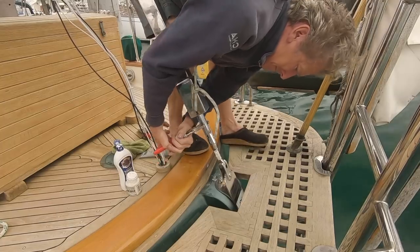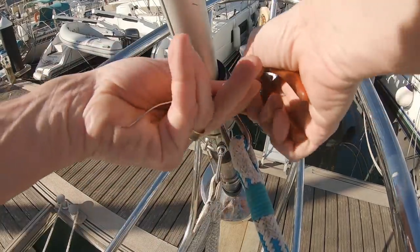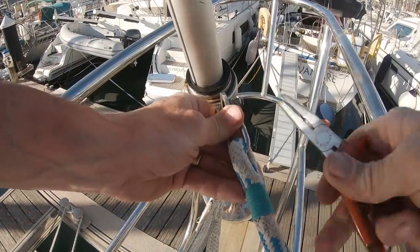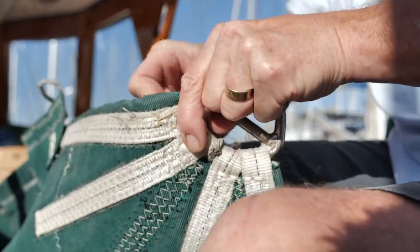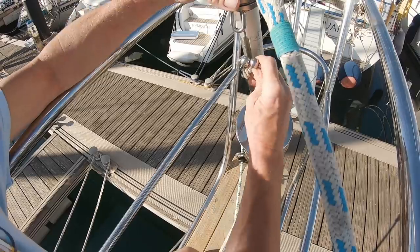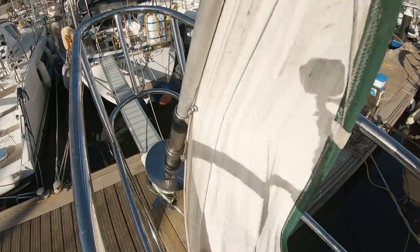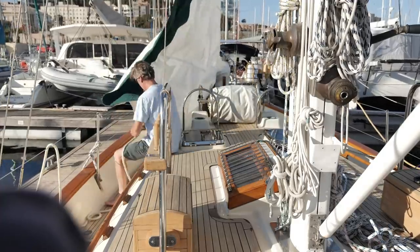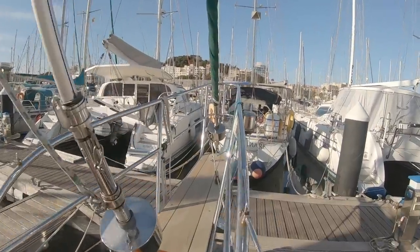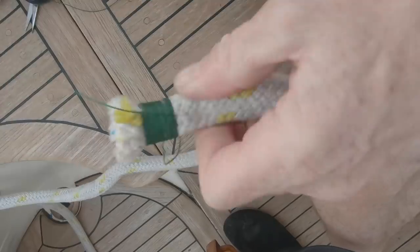The halyards can come off now and we can go around and tighten up the backstay again, all the way back down to its mark, and hopefully everything should be back where it was. Do all the shackles up nice and tight, then a bit of Monel seizing wire that I always put on to make sure things aren't going to fall off. Then it's time to put the sails back on — almost. I did notice a couple of frayed stitches as I was pulling the sail back out, so might as well get that done first. A handy little device feeds the sail into the track quite nicely. I'll put a bit of PTFE spray in there too, flake the sail out onto the bowsprit, put the sheets on with a couple of bowlines, and she's ready to roll.